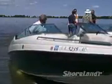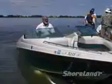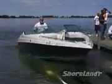If the ramp isn't too steep, you could also try powering the boat off the trailer using the outboard or stern drive. For this to work, there must be enough water for prop clearance and so that the intakes are submerged. Apply the power slowly and smoothly, just enough to get the boat moving off the trailer.